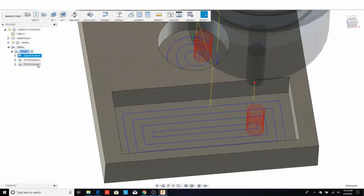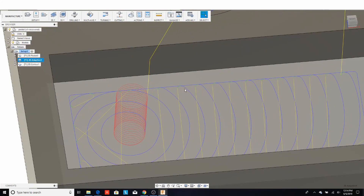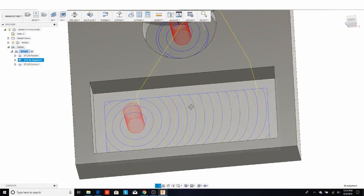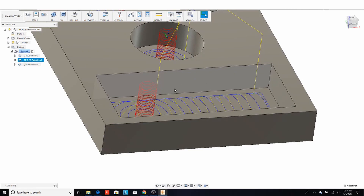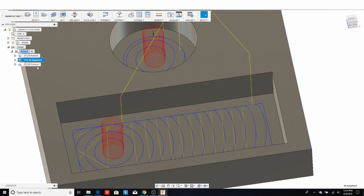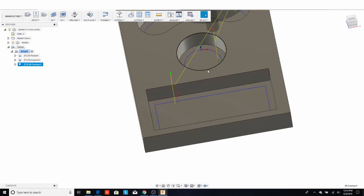The issue with adaptive is that as the toolpath comes around, it only makes contact periodically, and that causes some weird surface finishes. It doesn't leave a perfectly flat or very nice surface finish, and this can actually show on higher-grade mills. The way around that is to use a contour pass — use a roughing tool and then follow up with a finishing tool to contour it out.